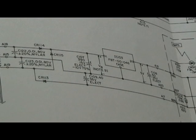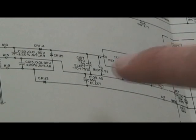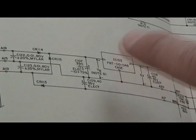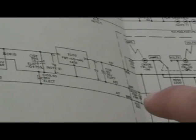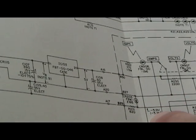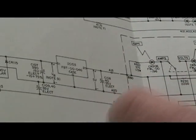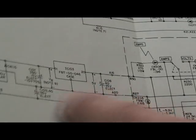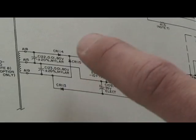The first thing I did when I opened up these Lambda power supplies was check the voltages going to the display driver chip. Here we have the schematic — over here is a zener diode regulator that's supposed to provide negative 5.9 volts to the chip, a 5 volt regulator, some smoothing capacitors, and here we have the transformer and some rectifiers.